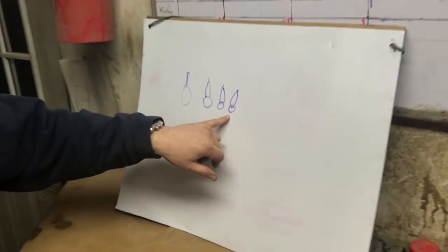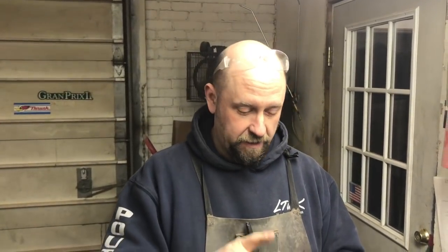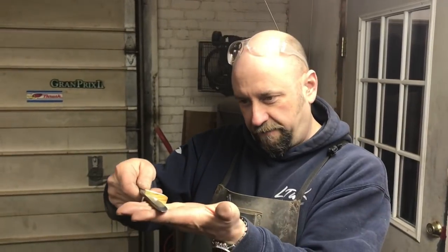This would be this thing that looks like a candle, sort of bowling-pin-looking thing. That means you buff the edge to get rid of your burr — that's the basics of sharpening a knife. Doesn't matter what grind it is, doesn't matter what the sharpened edge geometry is, doesn't matter how you get there. Burr, polished edge — you should have a sharp knife. If it's not, you've got to figure out why. You might have a burr, or you might have stropped the knife too steep, which will round the edge again. But first, I'll show you how to get a burr on the machine.